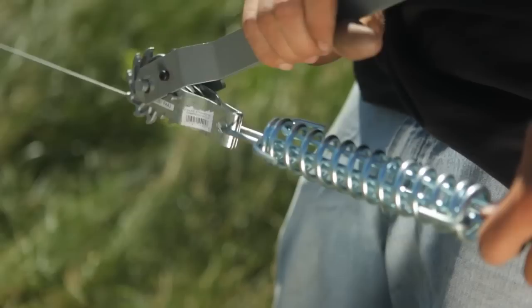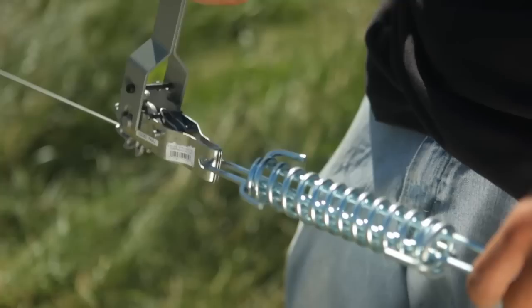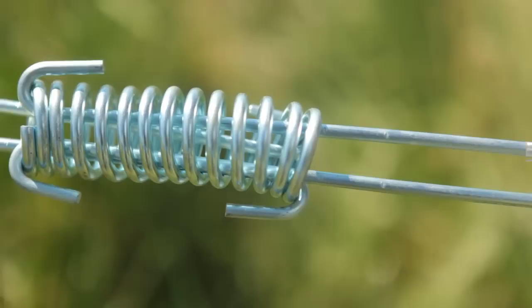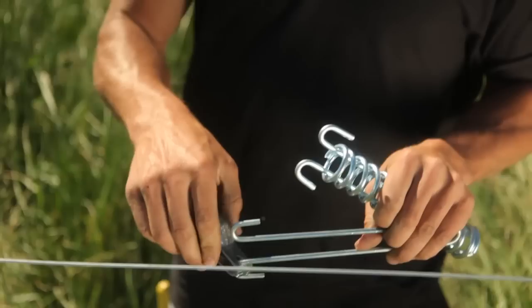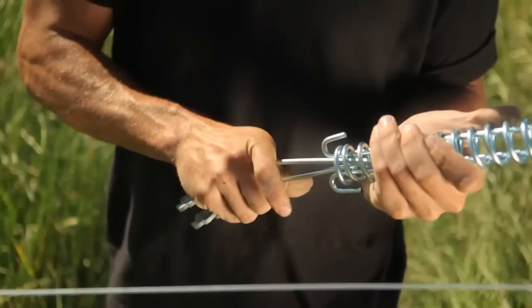On the second wire from the top, install a strainer and tension indicator spring to measure wire tension on the fence. If you are not using self-regulating inline strainers, the spring features full-strength tug links with marks to accurately measure wire tension. To install, pull out one tug link and thread it through the hole in the inline strainer strap. Next, reinstall the tug link back into the spring coil and attach to fence wire using two crimping sleeves.